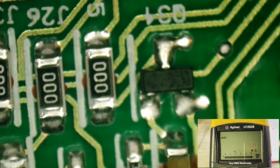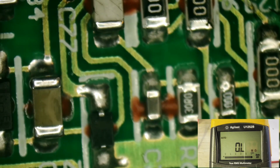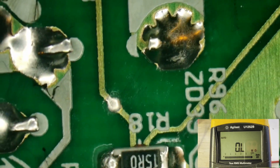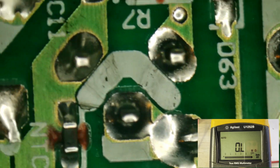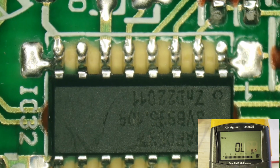Oh, this is looking good. Is this just going to be a bad ADP-400FR? It doesn't seem bad with diode checks, but diode checks aren't going to tell you everything. Just tell you if it's dead, shorted. I don't see anything burnt. There's like some dirt on this board. Looks like soot, but I guess it's just dirt. That may be the best place to start, is just swap that out. I do have some chips to put on there.